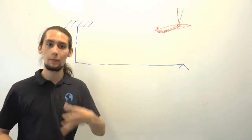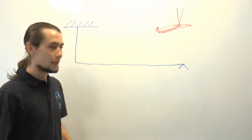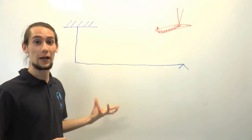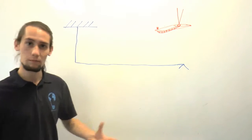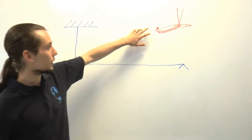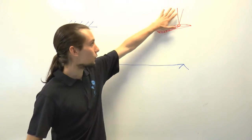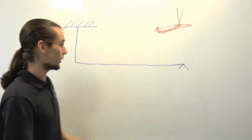We're going to look at the bending behaviour of the St Pancras lighting system just for the moment. It's not the whole story, but there is going to be some bending, and it's good to get a grip of how it's going to behave under bending. So we've got a diagram which is going to represent the lighting. We've got a fixed support here which is representing the more stiff support at one end, and a pin support which is representing those two struts which attach to it, the front, as we can see.